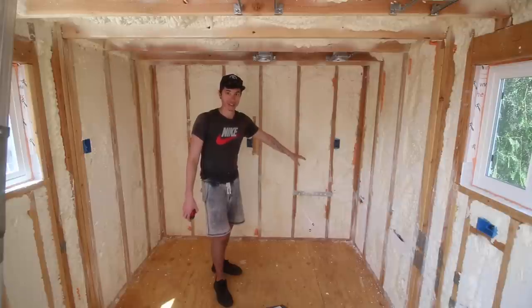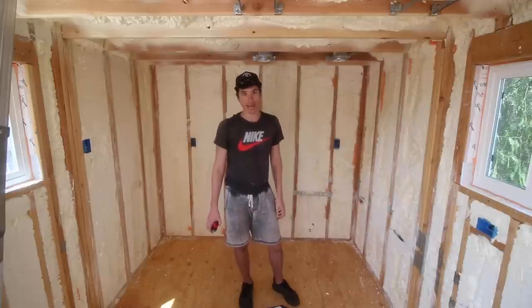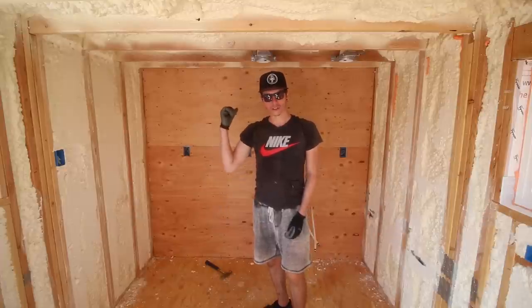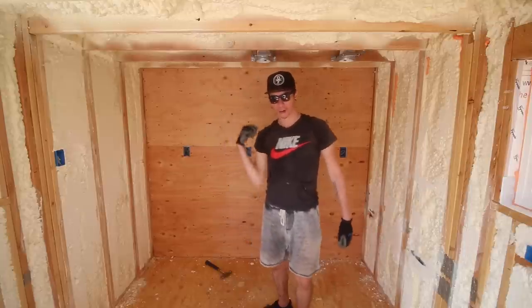The back kitchen cabinets are going to be going here as well, so again, really nice to have backing. That's why I'm installing the half-inch plywood on this back wall. I just quickly finished the wall — I'm going to head on home because I'm sweating like you wouldn't believe, and I will catch you guys on the next video. Talk to you soon. Peace.